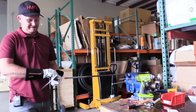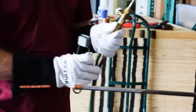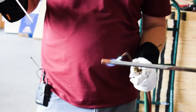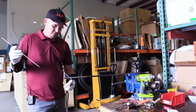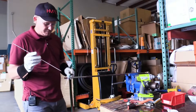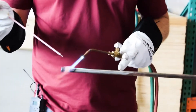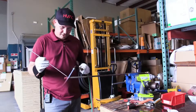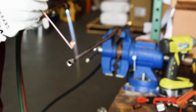This is our shop torch — you get used to your particular setup and it's annoying to use others. I'm going to apply heat around the joint, to the steel side, but not too far back. I actually use my left hand for the torch even though I'm right-handed — just a habit. By applying heat to the steel, I'm already seeing it start to get that cherry red, so I'm backing off. I need to get the flux to melt into the joint — without the flux it won't flow. There we go — we definitely flowed.